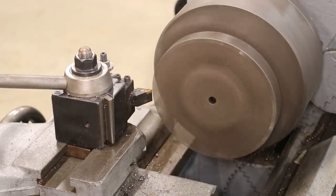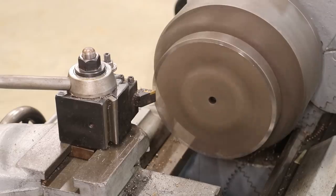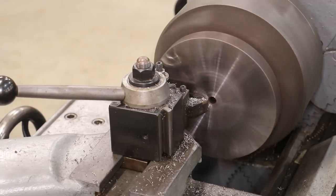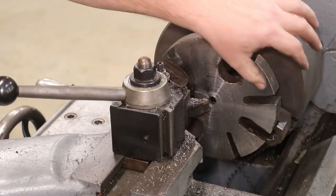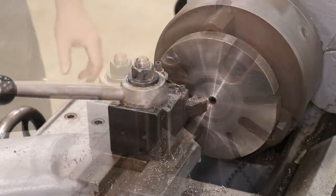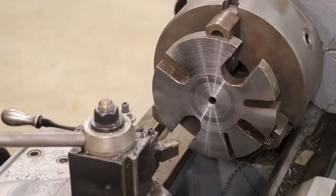We'll face down through there and clean it up. I'll probably do this with a couple of passes — I just don't want to take any more than I have to. So we'll take a light pass and then come back and take another pass if we need to. Let's see what we got. Yeah, I think I'm going to take a little bit more — I'm not liking the way that cleaned up in there. We're not going to be able to get it perfect, but I think we can do a little bit better than that. Yeah, that's a lot better. That's probably about as good as we're going to be able to get it. We'll flip it around and do the other face.